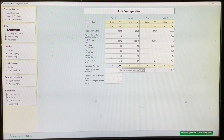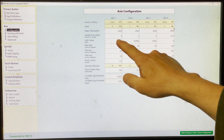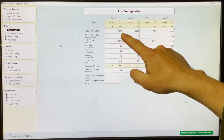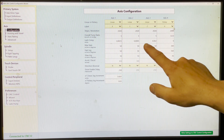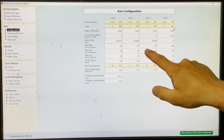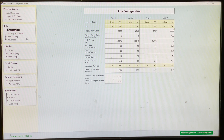When you're cutting, this is your speed limit for going fast. Jogging is your slow jog, and your acceleration time — whether you need to reverse the directions as far as positive or negative if your table's traveling the wrong way. I didn't make any changes here; this was all default. Really you only need to worry about the top two. Backlash — if it's a problem, you're going to want to adjust and set that in.